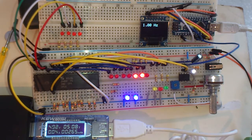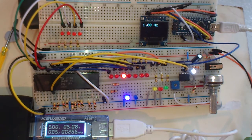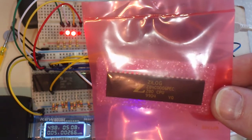And there are people who claimed, when I was researching this, that these older Z80s are made with something called NMOS technology. I'll let you look that one up on Wikipedia. I don't want to say something incorrect. They claim these older chips wouldn't be so stable at low frequencies. One of the nice things about the Z80 is the status registers are held in static RAM on the chip. So in theory, as long as power is supplied, the status registers should hold their values. Now, the specification doesn't guarantee that at such low frequencies as this for the original Z80s, but for the newer CMOS Z80s, they apparently do guarantee that, and you can just single step through cycles 1 a day or something if you wanted to.